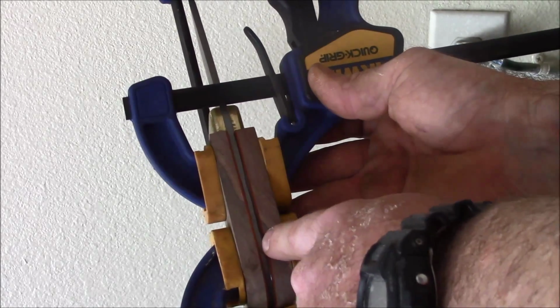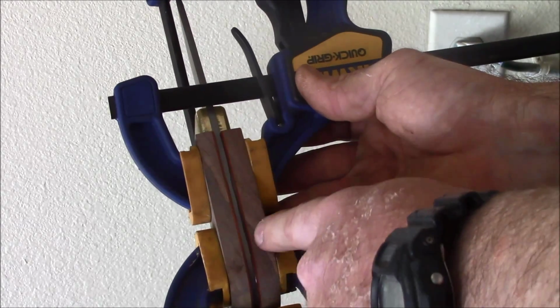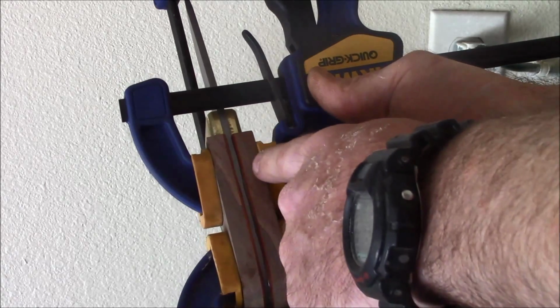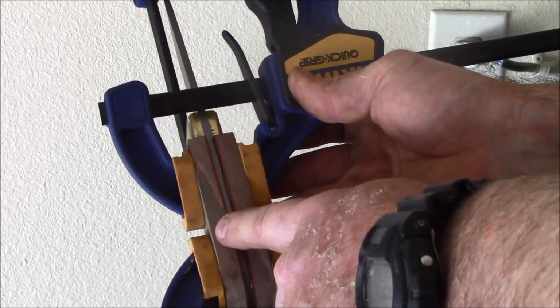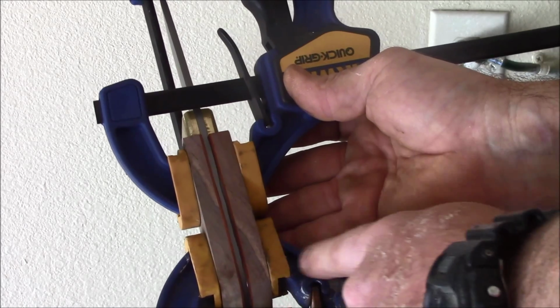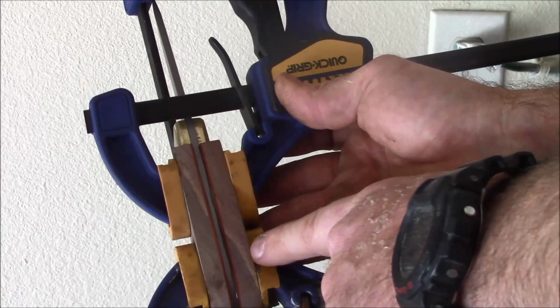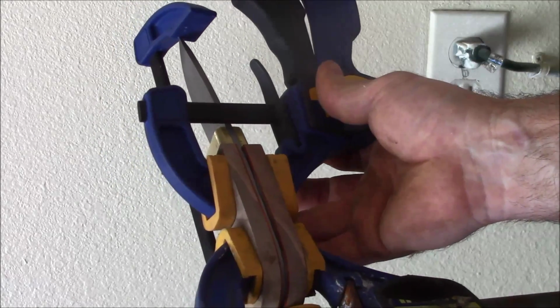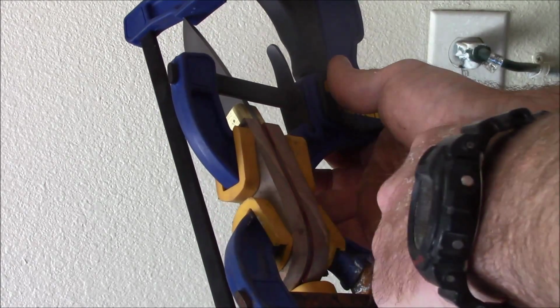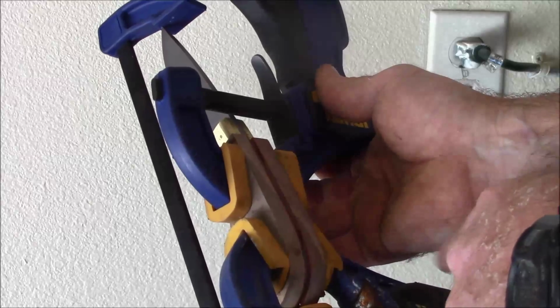These scales are done one at a time, one scale and then drilled for the location of the pins, and then the other scale. So right now the second scale is setting up, and then once it's completed we'll have sort of a drill guide for the pins so we can go run back across. This is where it starts really showing. All up till now everything you do is important, but this is where it all starts to come together. So we'll be back.